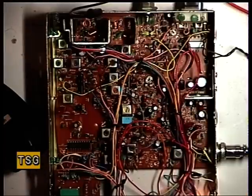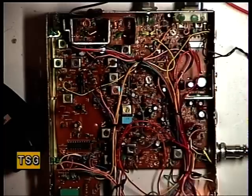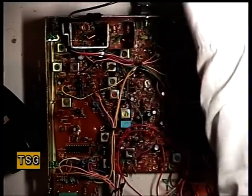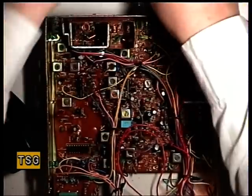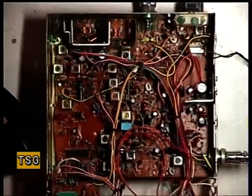We'll just get the other little oscillator out. That's slightly over the top so we'll just turn that down a fraction. Give it the whistle test... and that's now spot on. Now we need to check that the RF meter is saying something right - like four watts. We'll check that the RF meter is reading correctly.